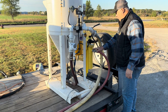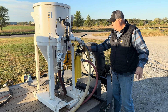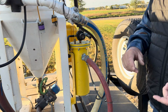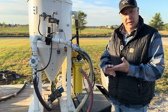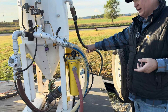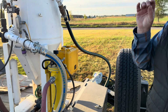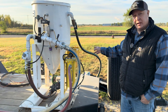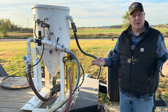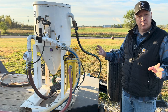Now we're going to hook up our system to our breathing canister. We have a breathing canister with a charcoal filter — it's actually a nine-stage filter in there that takes out oil, water, and odor. What it does not do is monitor for carbon monoxide to get Grade D breathable air. That's what this yellow box over here is — the COHP from Bullard, carbon monoxide high pressure monitor. It will alarm at 110 decibels and put out a light on a remote alarm hooked to the compressor should we exceed 10 parts per million allowable CO levels in our breathing air. Very important for safety.